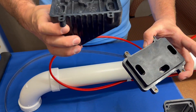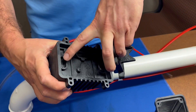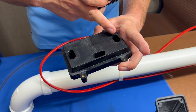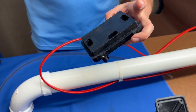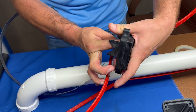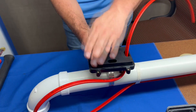Find the appropriate hole which matches up with the base of the box. For a single cable application, you'll use the hole shown, which equates to the corresponding knockout. First, feed the cable through the hole on the base and secure the base onto the pipe using a metal pipe strap. Fasten the pipe strap using a screwdriver.